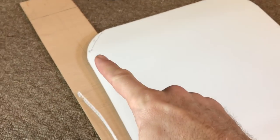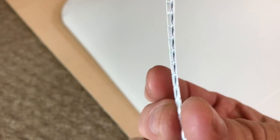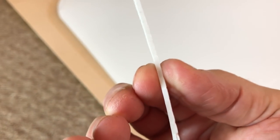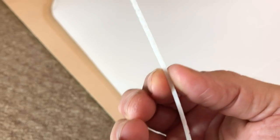This one's just a little too tight — I may end up taking just a hair off one side. Since both corners needed a little more material, I decided to size it down on this side. You can see what a tiny, tiny cut I've taken off there — and that made a huge difference. It popped in perfectly and came out without binding. So this is going to be just right.